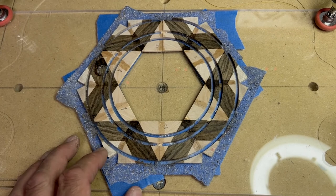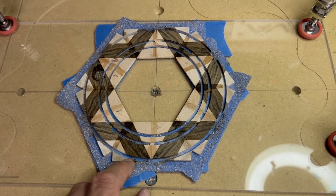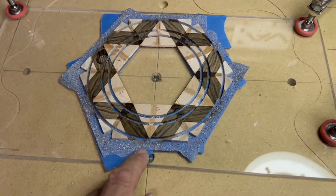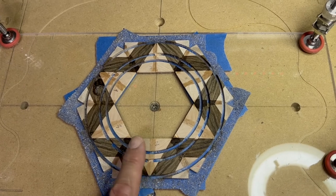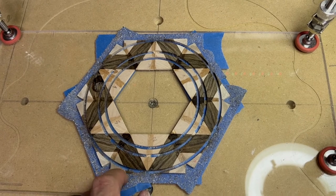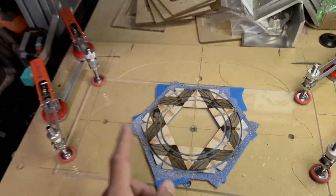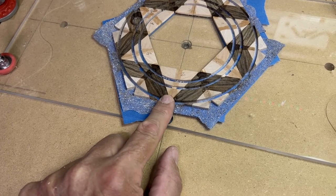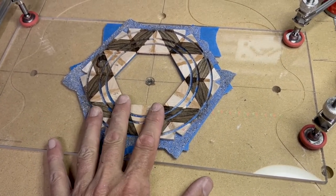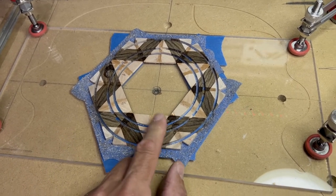I'm very pleased — this is number one. I did tabs here, eight of them around the circle, and I don't think I needed them. It's dialed in. I can't say enough good things about the Avid — they're not a sponsor or anything — but it was able to leave the tape, that's how accurate it is. It's within just a couple thou vertically most of the time when I run it, and if I flattened my spoil board more often it'd be even closer. The program's at 50 inches a minute and I'm running it at 25% of the speed. This material is an eighth of an inch and I'm cutting it in three passes — I just don't want to risk anything. These things are fragile and I spent a lot of time getting to this point.